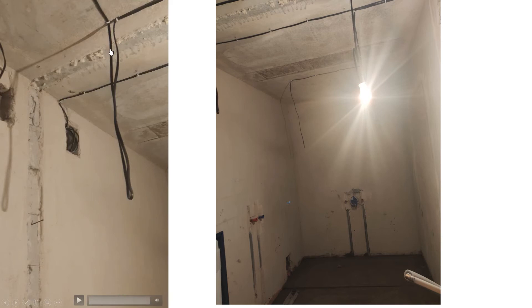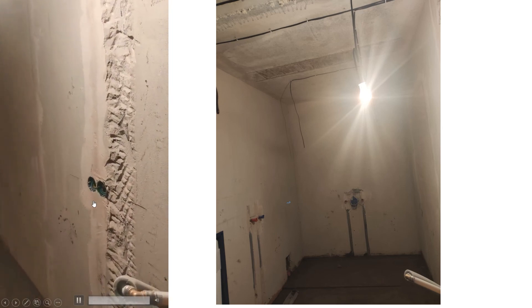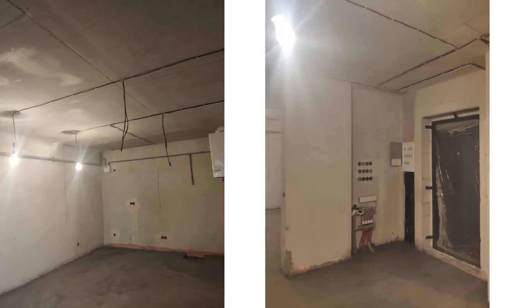More pictures of the wires hanging from the ceiling — they cut them and put in a light bulb just for testing. Here's the wire to the ventilation. The bathroom is going to have two vents — it used to be two bathrooms with one vent each, and now it's one bathroom with two vents. That double ventilation will be a unique selling point of the property someday. You can see the ceiling wiring and the outlets after they plastered around them to hold them in place, and here's the water line for the heated towel rack.